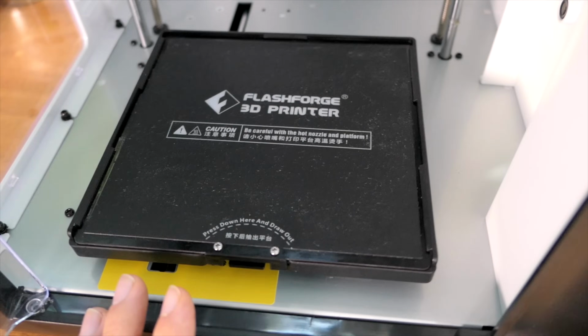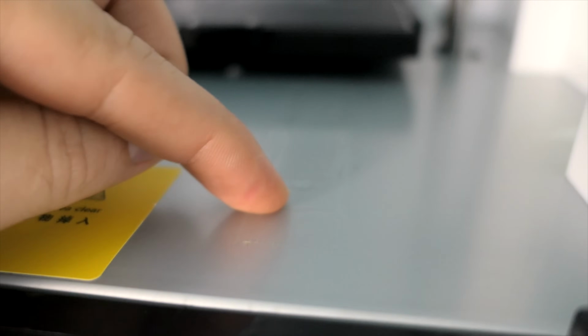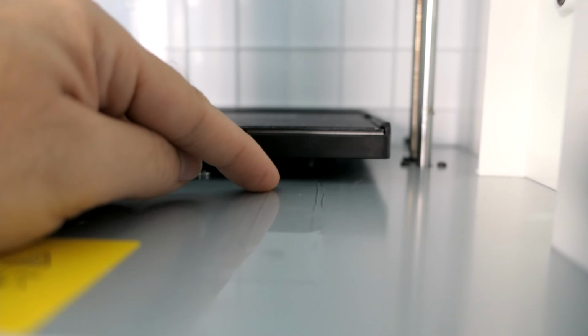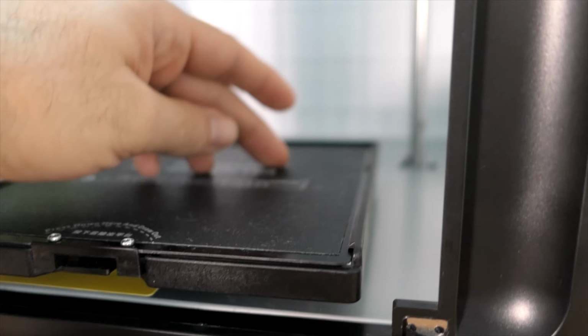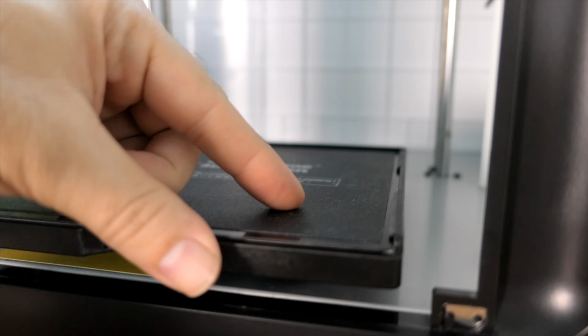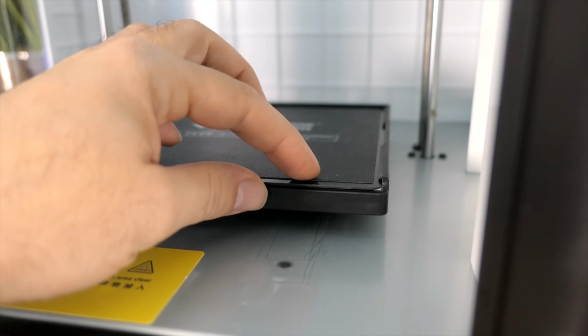And then the other part, which is kind of weird, but it worked: there's a little wheel underneath there, and that wheel rolls on the bottom here. I don't know if you can see, it's kind of hard to see, but there's tape right there. This is just clear packing tape, and I have a few steps. So as this thing travels, it goes higher, higher, higher, and a little higher. Once it gets here, it's in the highest position. This is how I dealt with it being too low here and too high here. When the nozzle's here, it's at its highest position, and as it goes back, it goes down slowly. So when it gets to this corner, it's good here too.